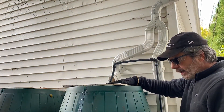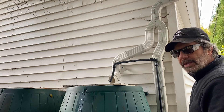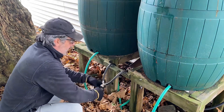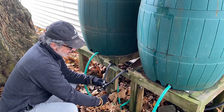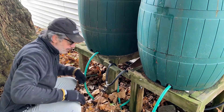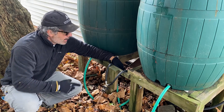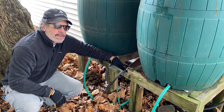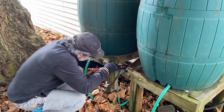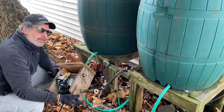I've shut off the flow and covered the lids, so nothing new is coming in. Now I want to drain these completely — get them as empty as possible so they don't freeze up and crack. To drain the barrels I just use my quick-connect connector, open that up, and let gravity drain them out. Then I'll come back and shake the line to make sure they're completely empty. I also have an electric pump in here as part of my rain barrel system — I take the pump housing and the pump out and store those inside for winter hibernation.